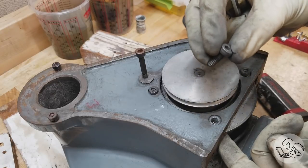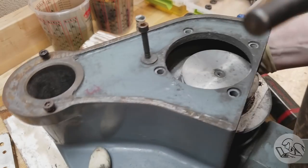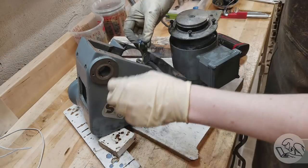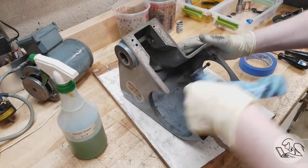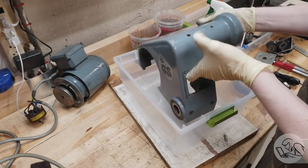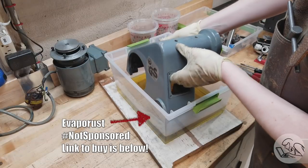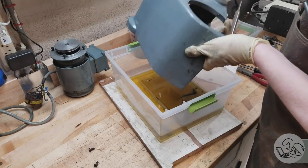Those cap screws have a shallow head on them but otherwise look pretty standard. Now that casting lifts right off of there, and indeed it does. Aside from being utterly filthy, the motor looks to be in pretty decent shape. There are a couple of stray ground wires from the switch and motor still in there — we fish those out, and now the entire electrical system is finally free of the grinder. I can give this upper casting a thorough cleaning. The machined mating surfaces on this casting are all pretty rusty. I don't have a big enough container to dunk the whole thing, but I can dunk just the edges. I set them on the lid of another container to keep them elevated off the bottom of the tank, and they came out very nice indeed.